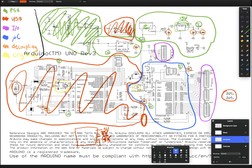But next, we're going to talk about the I/O connectors. This should be fairly brief, because there's not much complicated on the AVR, on this Arduino, sorry. But basically, all of the output pins can just be driven straight into the mechanical pins that will lay out on your PCB. And the thing I really want to point out is you can see here that it would be quite messy to jump lots of wires through here.